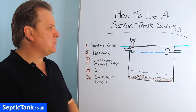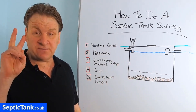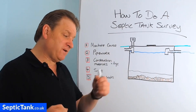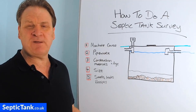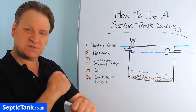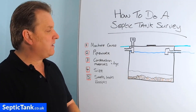Number two. When you want to inspect the inside of your septic tank, it's good to have two people — a friend to help you. In septic tanks you can get a big build-up of methane, and many people have lifted the lid to inspect it, been overcome by the methane, knocked out, fallen into the tank and been found dead at the bottom. If you've got a friend with you, a harness on, and you're connected to some kind of secure mounting, then if you are overcome by fumes you've got someone there to help you and stop you falling in.